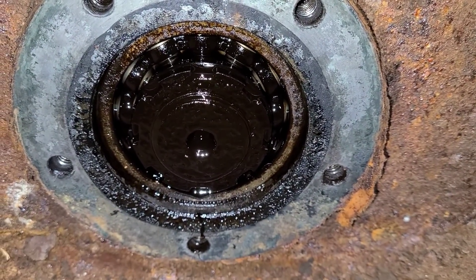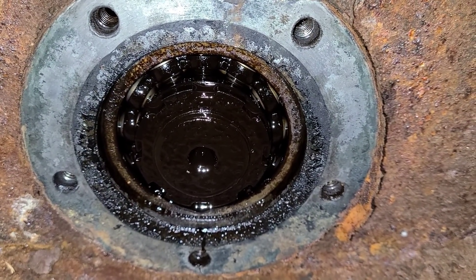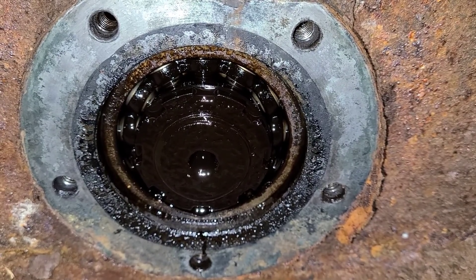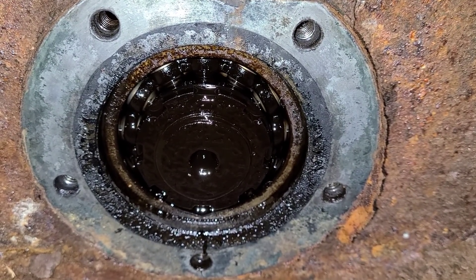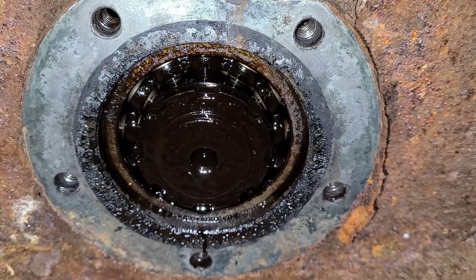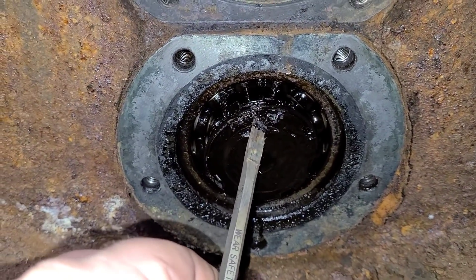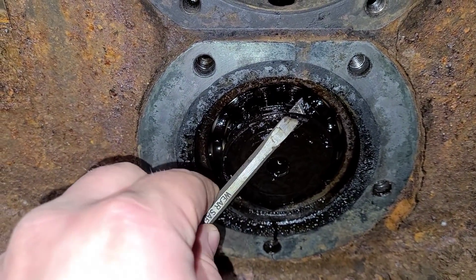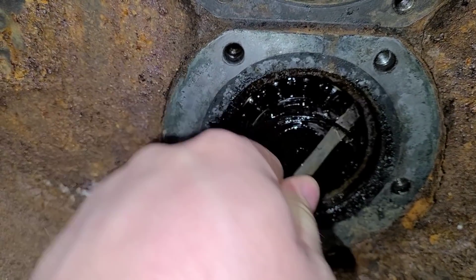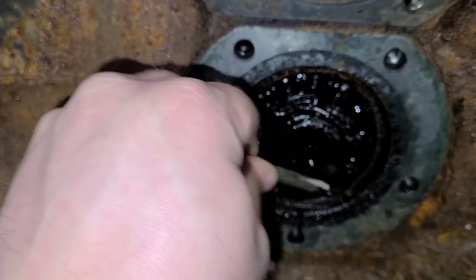It's just a spanner nut, and luckily I ordered a bunch of spanner wrenches and they came in today. There's a locking tab in there — we'll get that pushed back or flattened out and come in here with a spanner wrench to see if we can get those to move. Actually I was wrong: there is a snap ring in here — or they just call it a ring in the book, they don't say snap ring. We'll get that walked off of here.